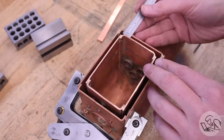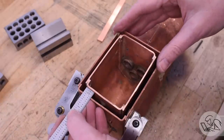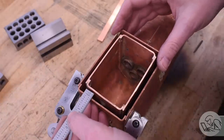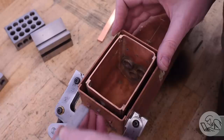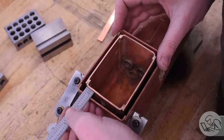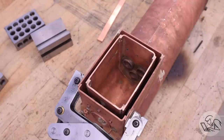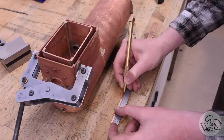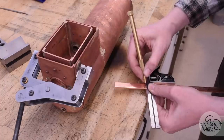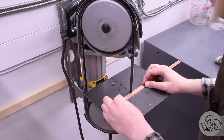I'm taking my time here, taking lots of measurements, making sure the firebox is sitting in a good place. Now you see why I took care to make sure the sides of the firebox were straight — fitting pieces into these gaps is going to be very difficult if things aren't straight. I don't want to have to try and file a whole bunch of gentle curves and angles if I can help it. This copper bar stock is what's going to be used to make these pieces — it's pretty thick heavy stuff, so it'll be nice and strong to hold back the pressure in the foundation ring.